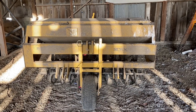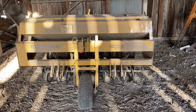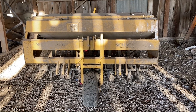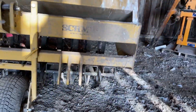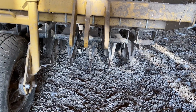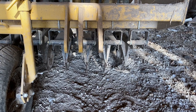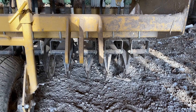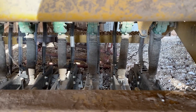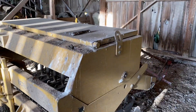This happens to be what we call a grain drill, or a seeder, and it's slender enough to go between the rows of grapes where we plant barley sometimes as a cover crop. You can see down low there are blades at an angle that cut into the ground a little bit, and the small opening or ditch that it leaves is where the seed drops. You can see the rubber hoses where the seed falls through.